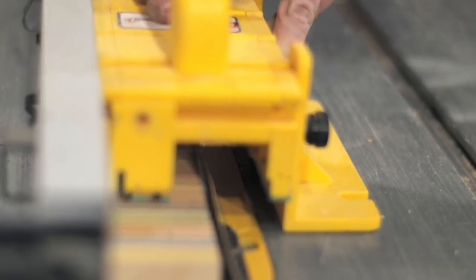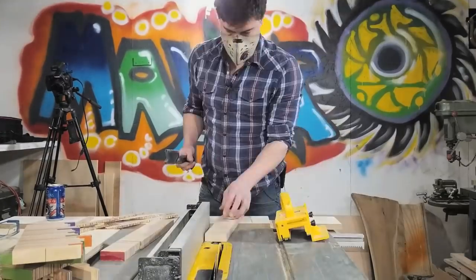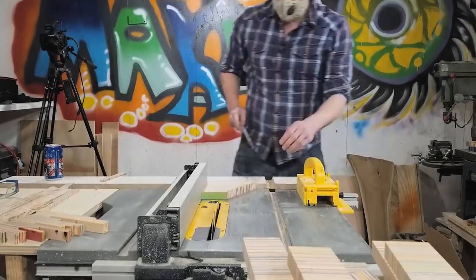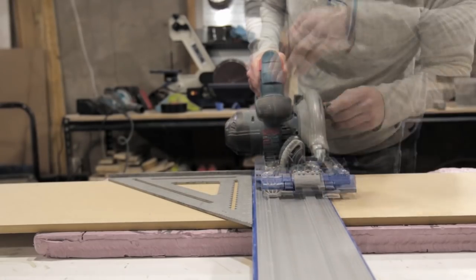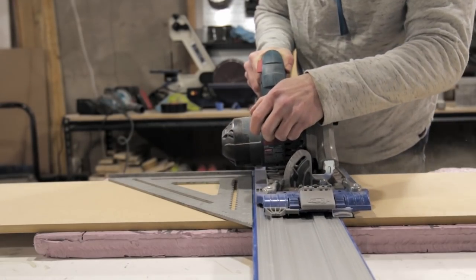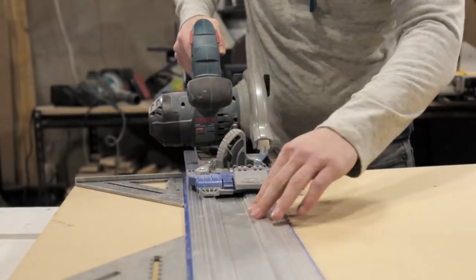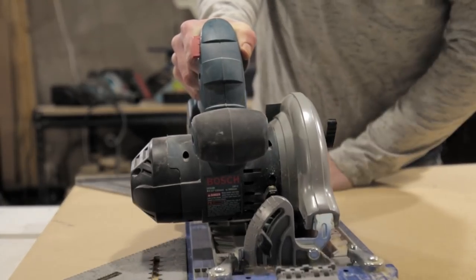Skateboards are essentially plywood with colorful layers. What Focus Skateboard Woodworks does is cut the skateboards into strips, stack them, and glue them up into panels that they can make furniture from. I got the offcuts and they were jagged, so I had to break them down and square them off like hardwood lumber. These strips of skateboard wood are going to form the front panel of the speaker, and to make the glue-up easier I'm gluing them right onto a sheet of MDF.